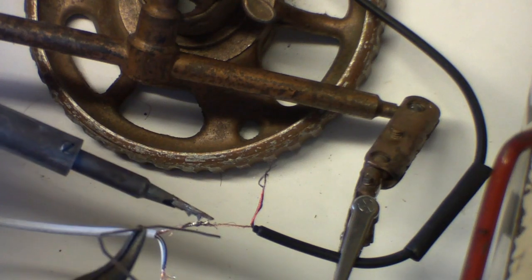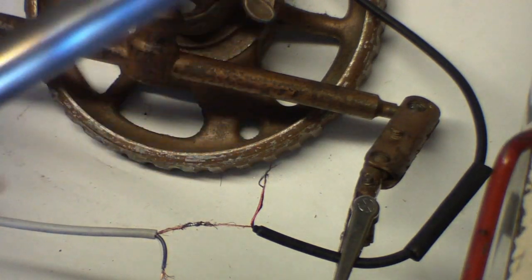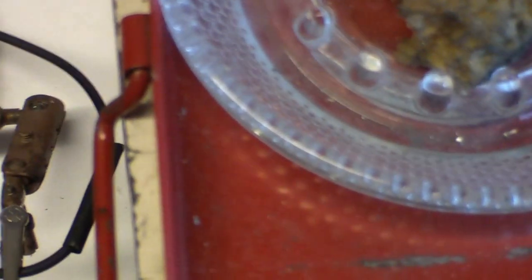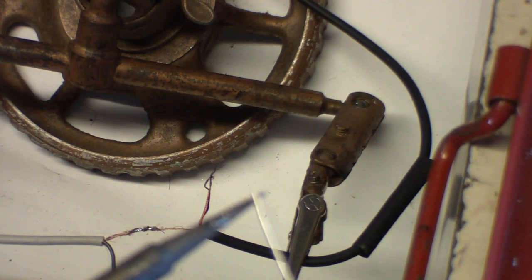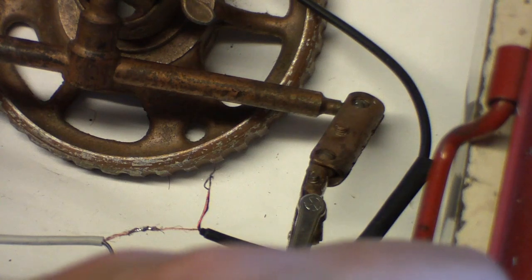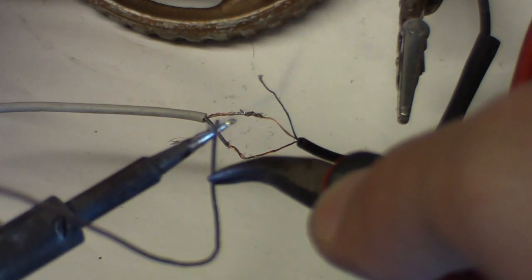You want to make sure it doesn't have points that stick up like a stegosaurus tail, because that could cut holes in your insulation later on. Then you want to clean your iron off — that's why you want to have goggles, so you don't get solder flying in your eye. Okay, that one's done. We've got two more wires to go; tin the iron a little bit first.